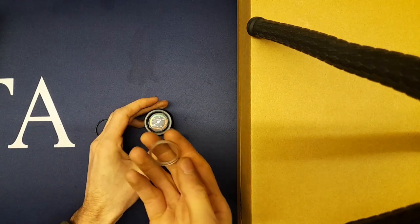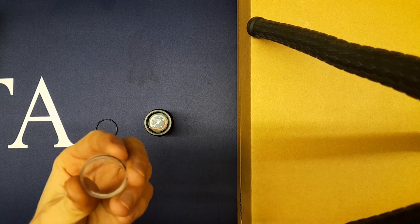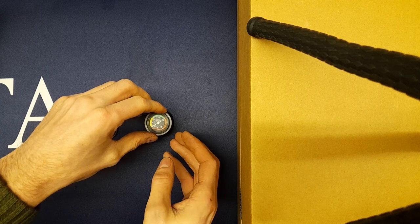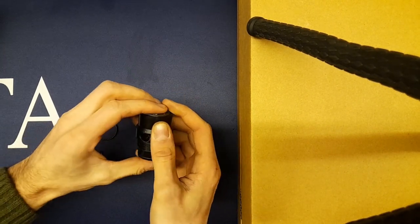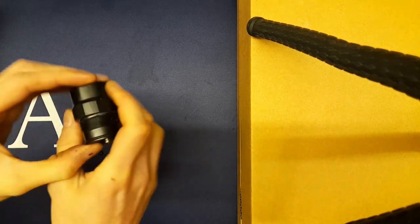Before putting the cap back on, make sure there are no greasy fingerprints on the face of the gauge — give it a good wipe and clean. Pop the cap back on: put it on like that and give a little push until it's seated back in place. Then pop the whole assembly back onto the cylinder and screw it in. I don't think there's any reason for it to be as tight as from factory, but give it just a little bit with the bar to make sure.